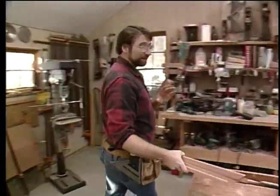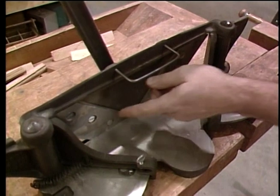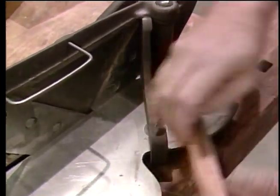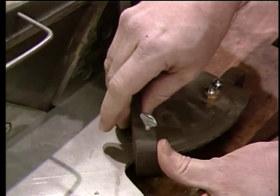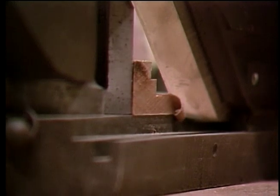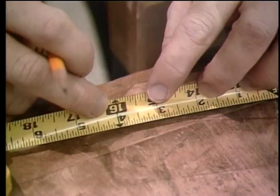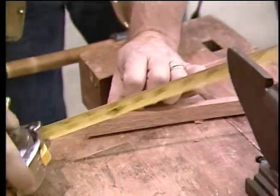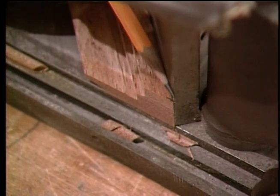I'm going to bring all these pieces to the workbench where I'm going to make the final cuts using this trimmer. It actually has an arm that you move back and forth, and there are two heavy cutters that act like a guillotine — they just shave the wood off. For guides, there are fences set up at 45 degrees now, but you can swing them to 90 or pretty much any place between. The idea is to just trim off a little bit of material at a time, shaving it perfectly clean. That's what I call fine-tuning a miter joint. Measuring from the end I just trimmed, I'm going to mark the exact length — for this short piece, 15 and three-quarters — then going to the opposite end of the tool, slide the piece in, aligning my pencil mark with the intersection of the fence face and trim it off.